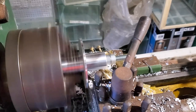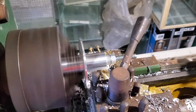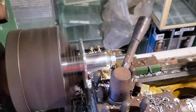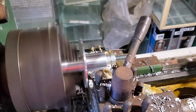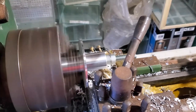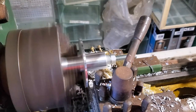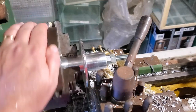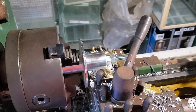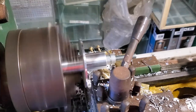The reason why I'm doing this — this is aluminum — I need a bracket to reinforce how the sink is going to attach onto the overflow system. What I'm going to do is make a bracket that is going to be bolted onto the frame for the rack, and that's going to give me a really steady and solid anchor point so that if I bump into this — which is going to happen, it's a fish room, I'll be moving around and banging into it — I don't want it to crack any of the fittings. So this is going to be my reinforcing. Normally a bracket I would just attach to the PVC or ABS and bolt it on, but I'm going to do something different here.